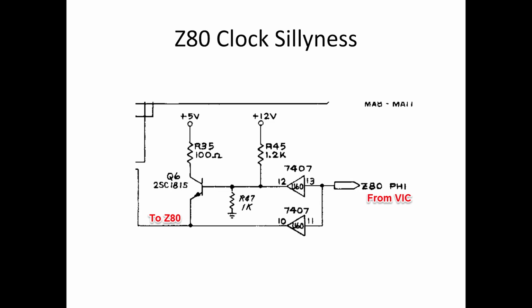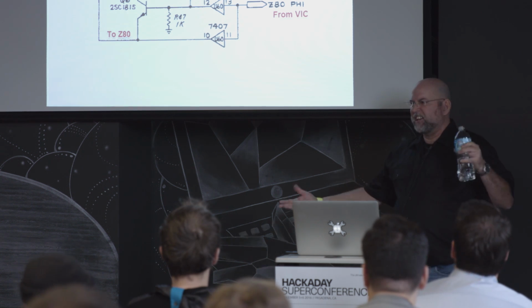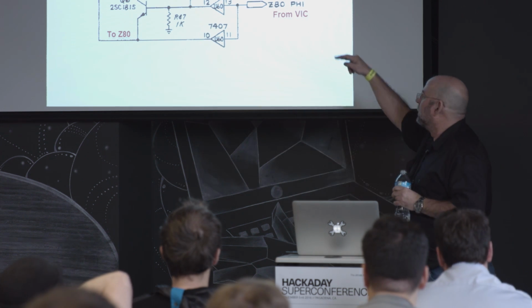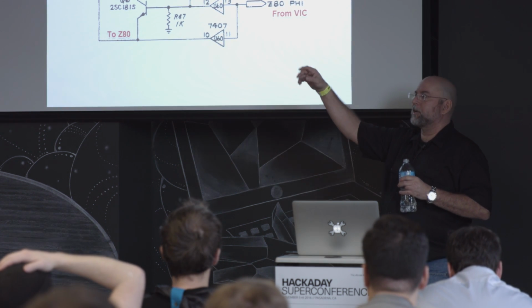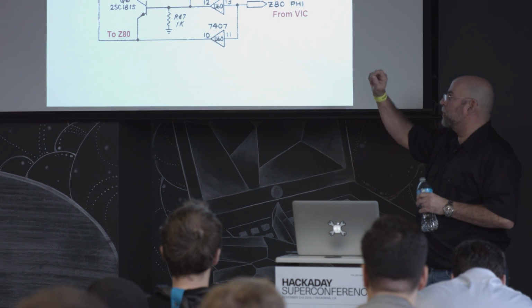So we're off to the races. VIC chip drops, right? By drops, I mean pops out of the oven first. And I'd gotten to the guy in time and said, when you do a rev of the VIC chip, I need a Z80 clock, unlike anything else. Everybody know what CMOS is? What's the C stand for? Complementary. It pulls high and it pulls low equally. What's NMOS? It means negative, right, or something. Well, NMOS is good at pulling low, and it sucks at pulling high. It goes to 4 volts, and then it kind of just peters out. And it didn't work.